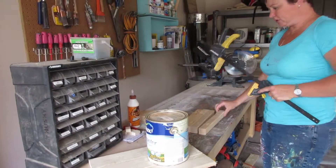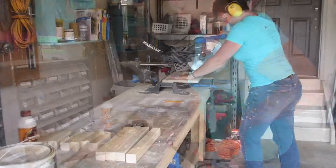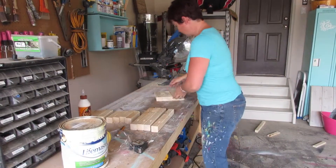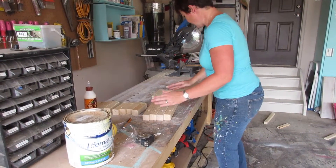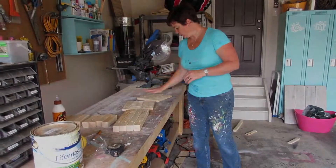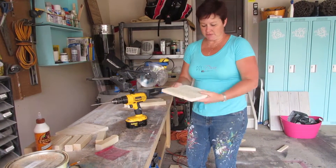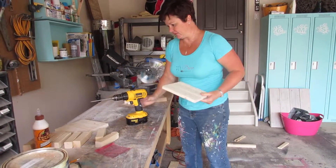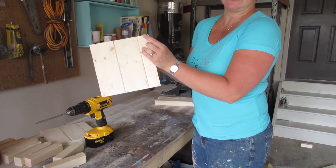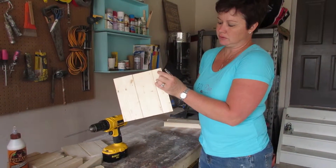We've got all of them pre-drilled top and bottom. We're going to go back now and cut our base because that's what we're ready to drill into. Beautiful top and bottom and sides — we're almost ready. Now I need to do a little sanding to get the rough stuff off; it's harder once the piece is put together. Just a light sanding is enough to get the really scruffy, rough stuff off. You can do better sanding afterwards. You want your pocket screws — and you can do this, by the way, by just gluing and screwing through the other side if you don't want to use the Kreg jig. Just pre-drill your holes because the wood cracks.